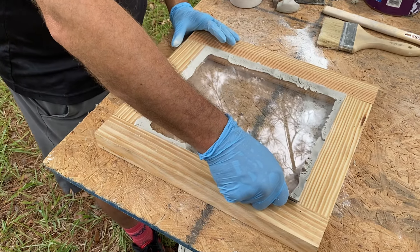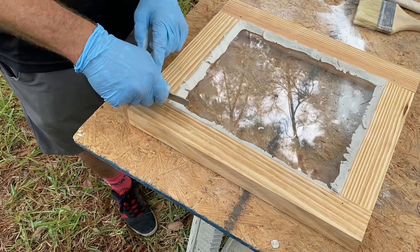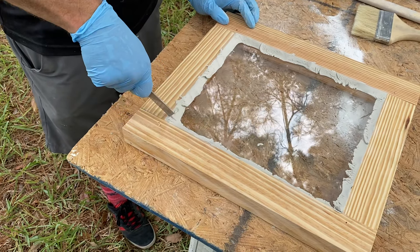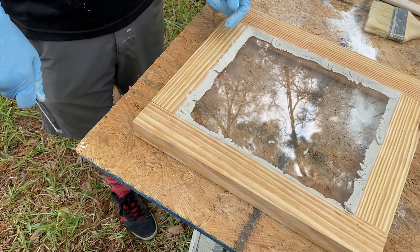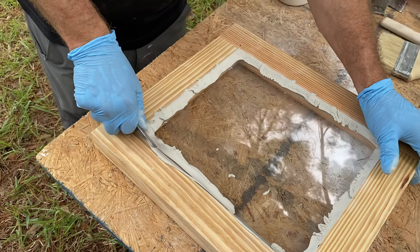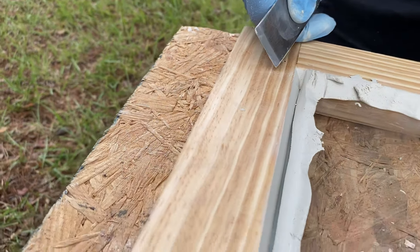Then I'm going to pull all the way to the end. I maintain this knife angle the whole way. When I get to the bottom rail closest to me, the edge closest to the glass is going to hit that rail and slide up. I keep the point on the glass and then I exit diagonally. All those little things are contained in this one first movement. Watch — I come up, start sliding up, and out. See how I create a little corner right there.